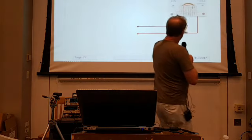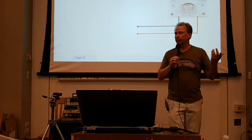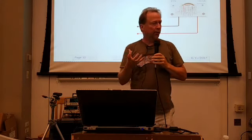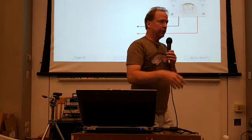So if we want to change the full-scale voltage of a meter, like this meter says it's a 5-volt full scale, but the meter itself is probably a 100 microamp movement or something. So it isn't really a voltmeter per se until you put a resistor in series with it. It's quite simple to say: we add a series resistor, we'll call it R sub S.